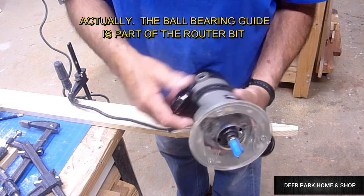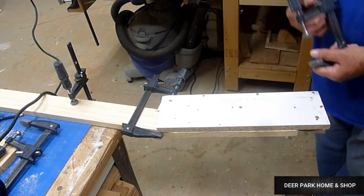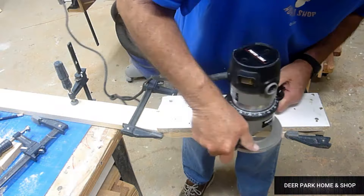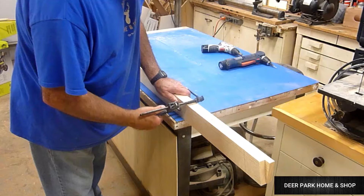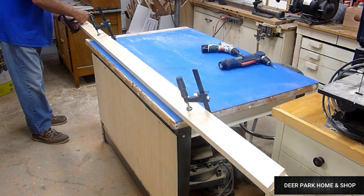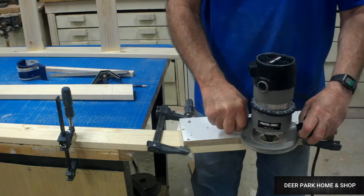We're using a router that has a ball bearing guide. Be sure to set your router height so that the bearing will ride on the edge of your jig — otherwise it will gouge up your ladder side. Reposition your jig on the reference line and clamp it in place. Now you can route off the excess. Don't forget to move your clamp before you route to the end of the board. We now have side A with our angles just right. Sandwich your two sides together, flush them up all the way around and clamp them together. Now you can transfer the angles to side B with your pencil. Separate the sides and using your jig and the same procedure as before, trim off the top end.